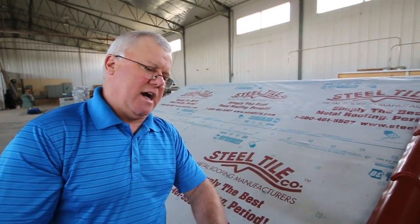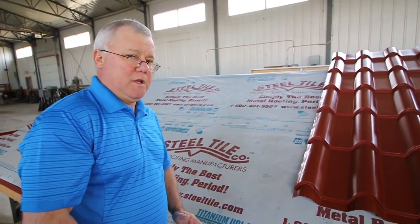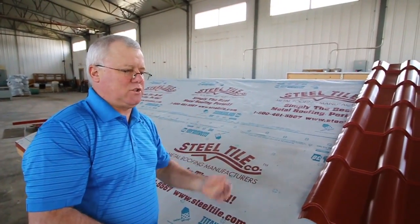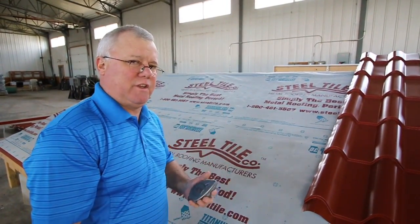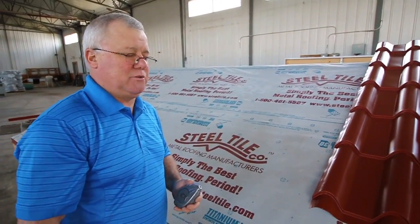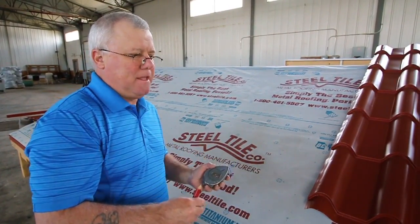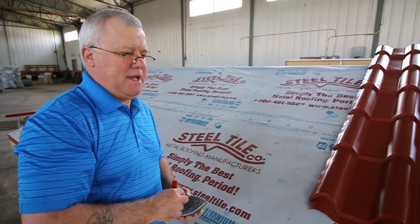What we want to show here is how to start off a KTEC Elite or Slate Shake panel. When you're doing a roof, a lot of times the eaves along the house are not always straight, but you want to track straight with your panels because you don't want to end up with too much overhang when you get down 50 or 60 feet on the other end. One little trick to keep yourself going straight is to chalk a line along the bottom edge of the roof.